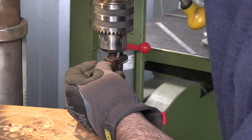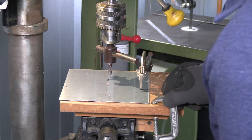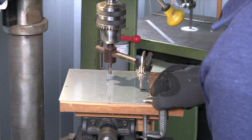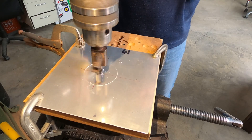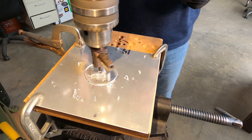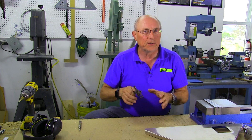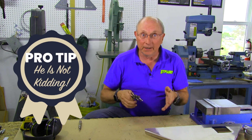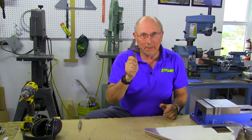Used properly, it works very well. By using properly we mean chucked up in a good drill press with the workpiece clamped heavily with numerous clamps so it can't go anywhere on a wooden substrate. There's a lot of setup involved to use a fly cutter. If you don't take every single step and every precaution, you are going to create a catapult that will fling your workpiece across the room and embed it in the sheetrock. How do I know? I've done it. So I look for ways to not use a fly cutter anytime I can.